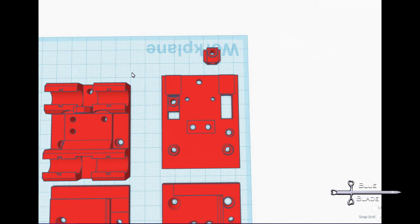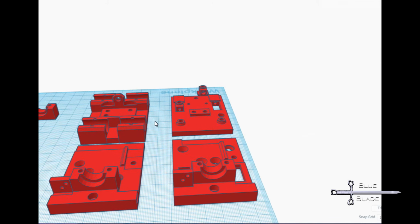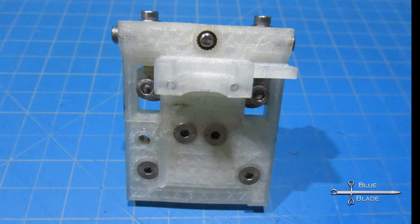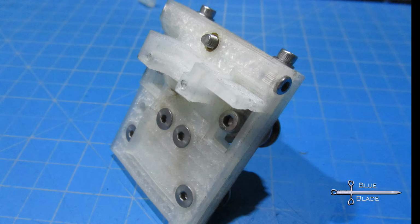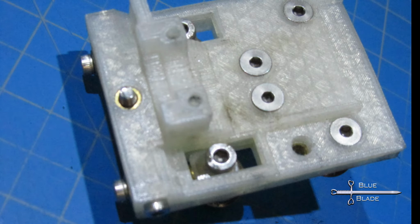I tried to stick to the wheels at first. That's the version on the left. But the wheels on rods just don't work. The rods flex too much. Perhaps it'd be alright on sturdy rails, but not on 6mm rods. The final version uses linear bearings, and that worked much better and increased my print quality.